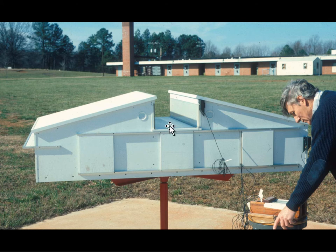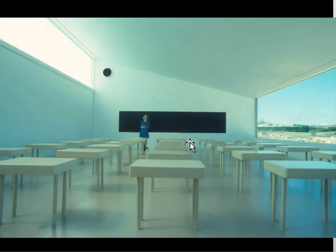The analogy of the frosted bulb applies when we put some diffusing glass in the aperture. When that's looked at from the inside it's still very bright and can be disturbing — just like the bare frosted bulb can be disturbing — but it's at least not damaging any longer. We don't have beam sunlight entering through this south-facing aperture; we have diffuse light coming through. However, this diffuse light is really disabling if you have a blackboard on one wall and you're trying to see a dark task while this intensely bright source is in your eyes.